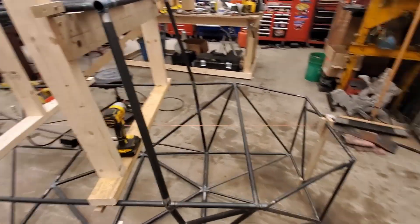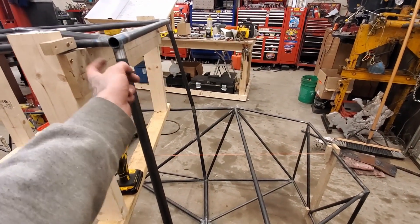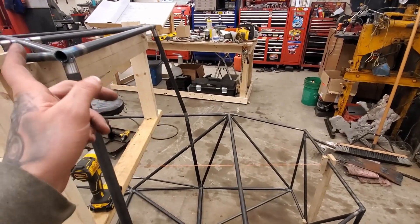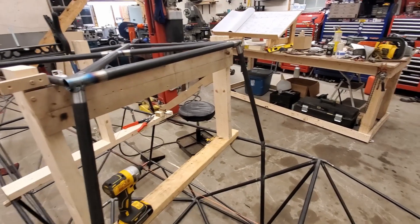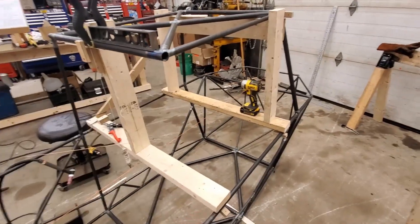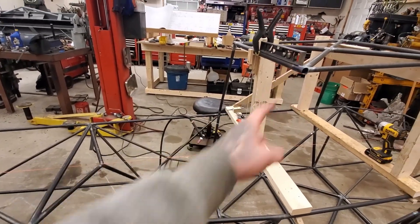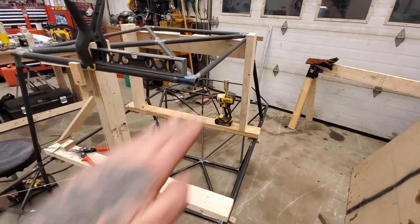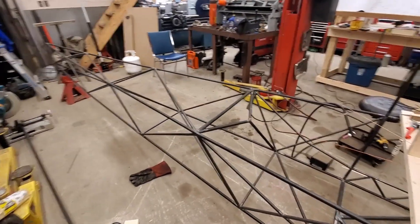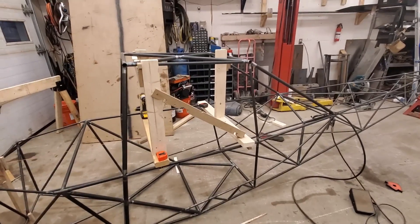If you're paying attention you'll notice I said I was going to add this tube that comes down here, but it's a little more pain to do it that way. I just like starting with the larger diameter — which is one inch — nearest the three-quarter, so I'd rather put the one inch to the one inch, continue on that way, and then put the three-quarter on top of this and come down. The X-brace one is pretty sure just comes a little bit inside of it. I'll get this one in place and then maybe put the two back ones in that go from this point up to the rear attach fitting, and then work on some front ones and keep moving around like you usually do.